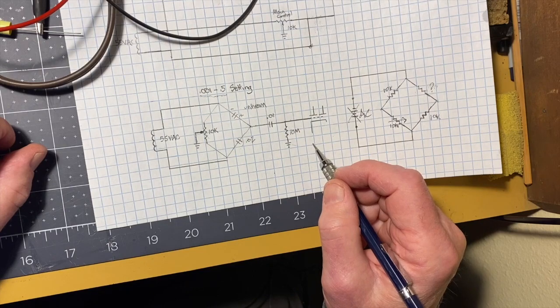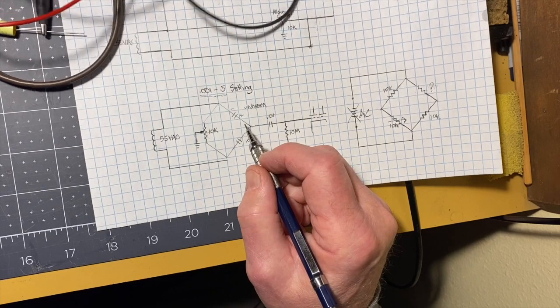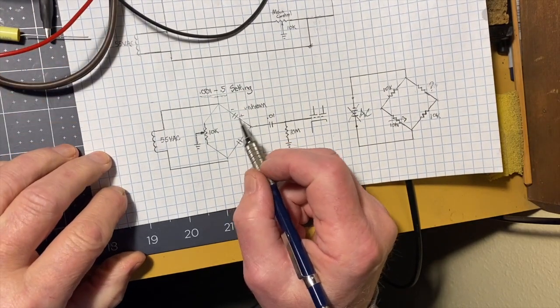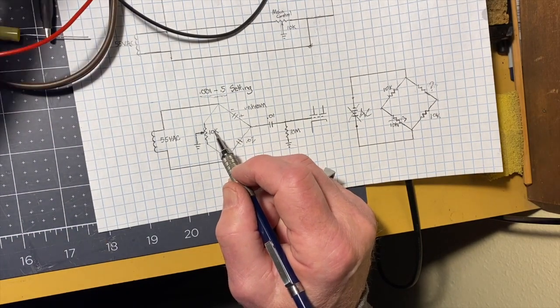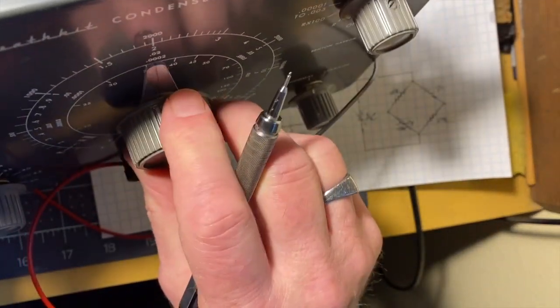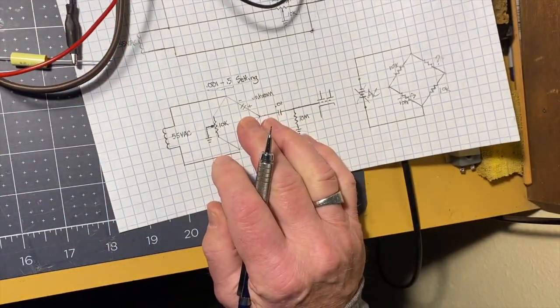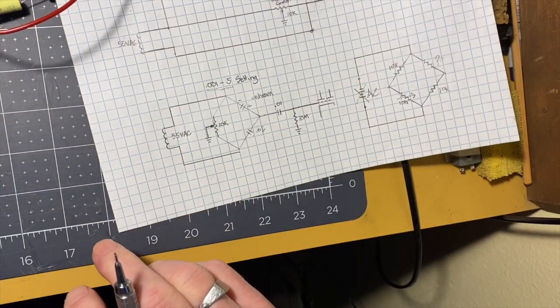It's fairly straightforward. Even if you could build the scale. If you had a bunch of capacitors and you knew the values, you could plug them in here and tweak this back and forth and find where on this scale right here those map out to, and then extrapolate all the capacitance values if you wanted to. Or you could just buy a Heathkit C-3 condenser checker, your choice.